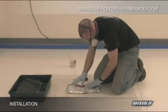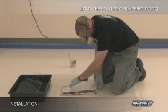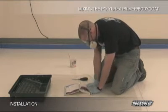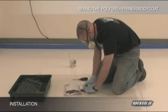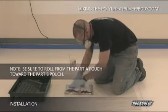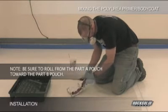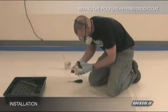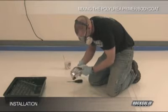Any clumps need to be massaged to break them up and blend them into the rest of the coating. Do this on both pouches so they will be ready for mixing prior to breaking the middle seal and combining the two components. Combine the two components by placing the pouch on the ground and rolling it like a tube of toothpaste. This will create pressure on the Part B side and force the middle seal to break, allowing the two components to mix together. Thoroughly mix the materials by shaking the pouch back and forth and squeezing the edges and corners towards the center of the pouch.